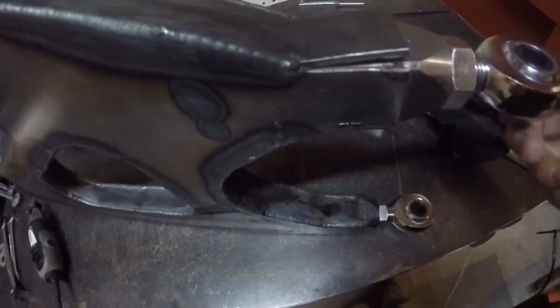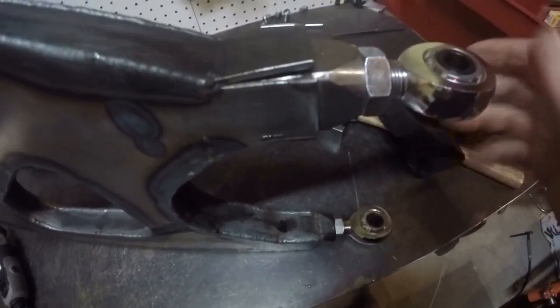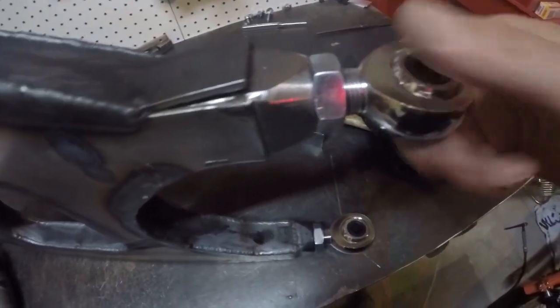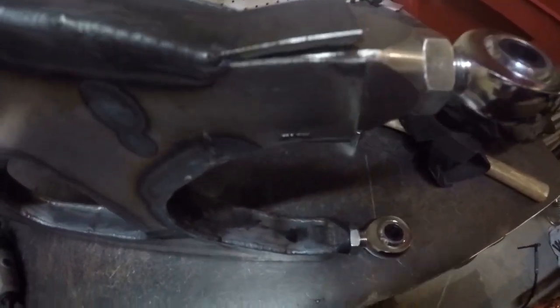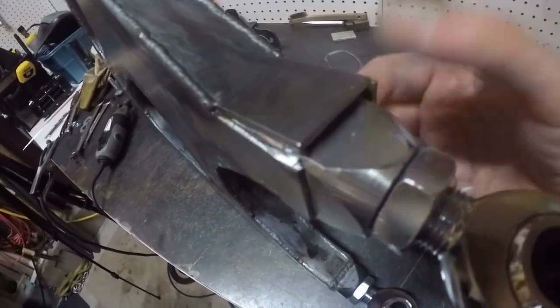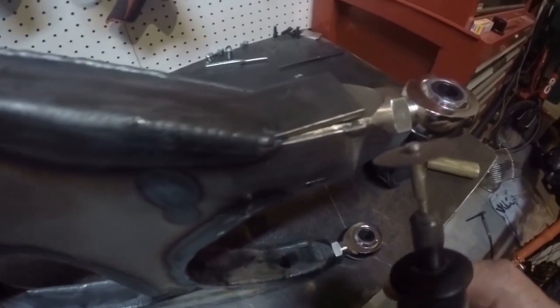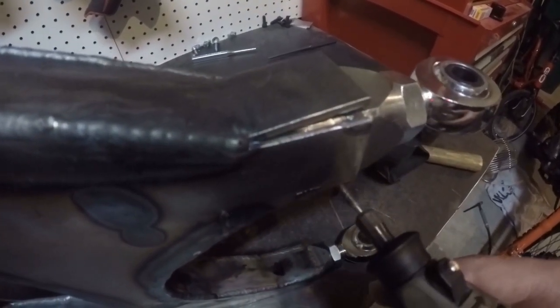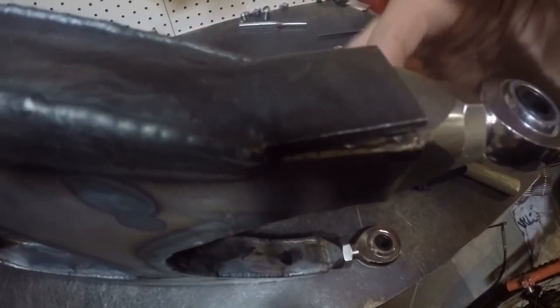What I'm going to do now is spin the heims in here and install the spindle to see how it fits. I sized this up and it did warp a little bit — I'm sure it's from when I welded this part here, it draws these together a little bit. It's really tiny and it will actually bolt together, but I can feel the resistance in the heims and I don't want that. I want them in there naturally so they're not wearing out any faster than they need to. So I've peeled these tabs back a little bit. I'm going to go in with the grinder, knock out the tack on both sides, then reassemble it and get this heim exactly where it needs to be, vice grip it down tight, put some tacks on there, and test it again.